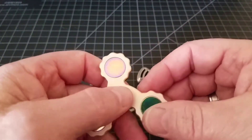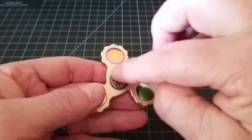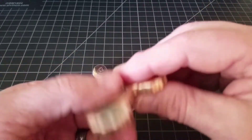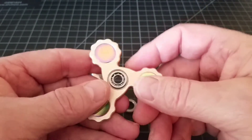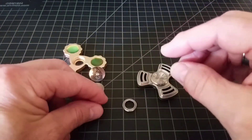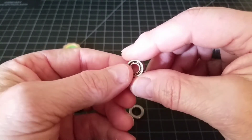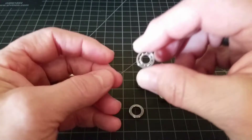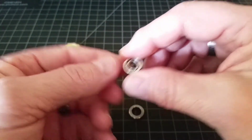After rinsing, I put the bearing back into the spinner. Before putting the retaining ring on, I get the bearing placed in nice and straight, drip some Dawn soap into it again, put the retaining ring back on, and spin it for about 30 seconds — flipping it over and spinning it the other way so it spins both directions. I get the soap worked in really well, then give it a thorough rinse. I use lint-free paper towels to dab it dry, then a couple shots of compressed air to blow out the remaining moisture.